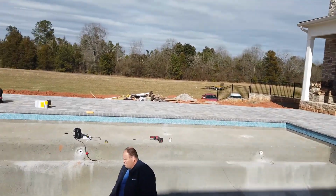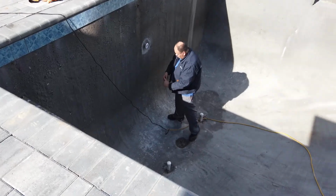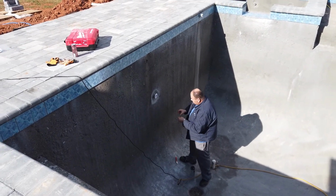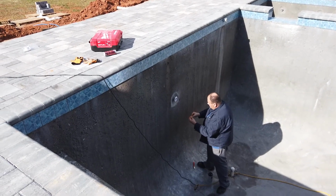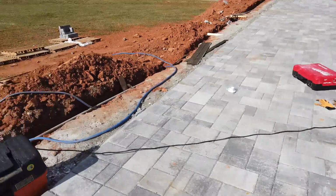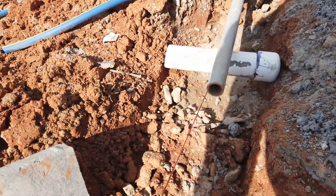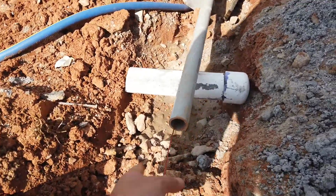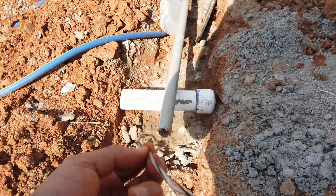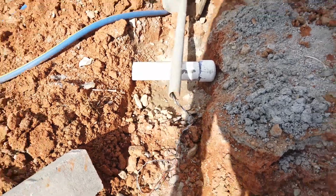So right now what Paul's doing is he's about to tie our actual pulling cable up to the small cord. Small cord goes through the pipe really easily. That pulling cable doesn't quite go through as easily, but he's going to attach it to that, and then we'll just pull it through the wall real quick, and then we can attach the actual electrical cable up to our pulling cable, and he's got it on right there. And this one was a rather short run. The other one was about a 100-foot run. We didn't videotape that. There was a lot of swearing involved in that one. And there it is. So now we can hook that up to our cable, and this will hold a couple 100 pounds where this guy won't. But this is pretty ideal for pulling through with the shop vac.